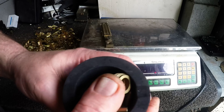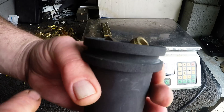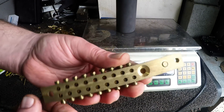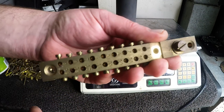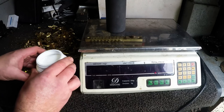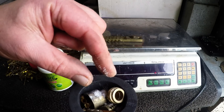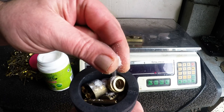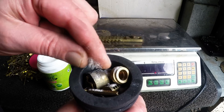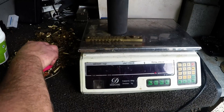I managed to stuff it all in carefully and that's pretty good — just a little overlap there. That's about three-quarters of a kilo, and all I've got left is just this bar to add in later. I'll heat it up before I put it in. I'll add a little bit of Borax to it now. With the copper I only put a pinch — I'll probably put twice as much in with the brass, because the brass is mixed and it's mostly copper but it's got a lot of other things in there too. Because it's all different types of brass, there could be a lot more impurities, so I'll just add a little bit more Borax. That should do it.